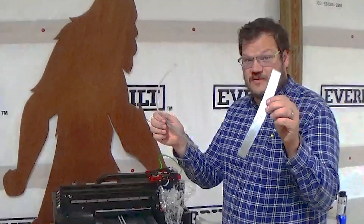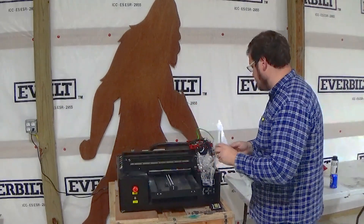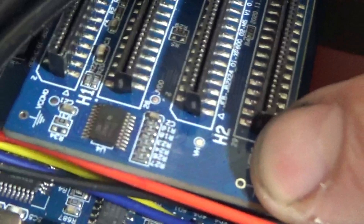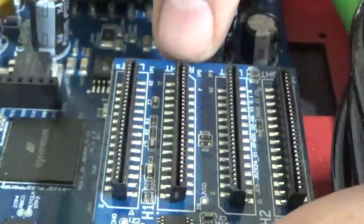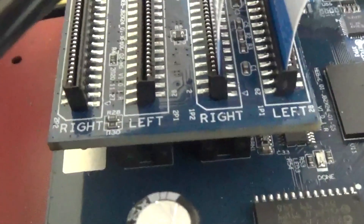So we get ourselves some new cables — we have these available and I'll put a link in the description below. So this is H1 and the reason why that's important is because on this board you'll see H1 for head one and H2 for head two. This is our color head, which on the XP600 takes two sockets or two cables for a left and a right. On the other side of the socket it says left and right, referring to the left side and the right side of the print head for CMYK for H1.